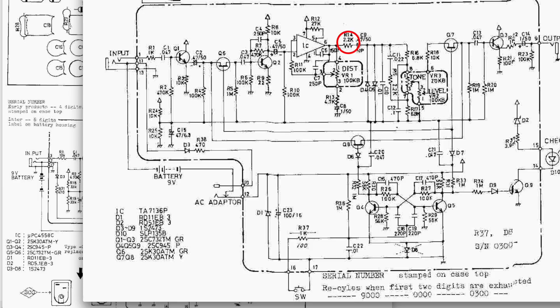Instead, the sound exits out and goes right past these diodes here. These diodes clip the signal in a hard-clipping fashion, basically making it a distortion. You see a capacitor here — combined with that resistor, it forms a low-pass filter, which takes off some highs and gets rid of some of that fuzziness. Then we go into this tone control, which is resistors and capacitors — basically the same type of tone control as on a Big Muff. Turn it all the way down and it boosts lows and decreases highs; turn it all the way up and it decreases lows and boosts the highs.